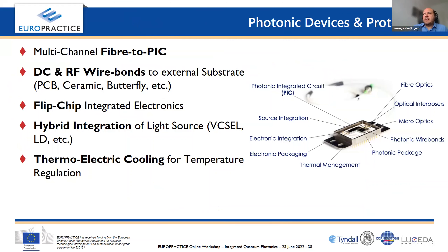Typically you'd have a chip — in this case it could be a photonic integrated circuit — and you need to think about the optics coming in, whether it's multi-channel or single channel, and the electrics on and off. Is it going to be a standalone chip in a lab? Are you going to have a PCB that you put your chip onto? How are you going to communicate between the chip and the PCB? What kind of technology connects the two — is it standard DC current or do you need high-speed technology?